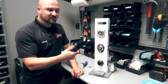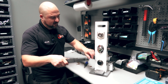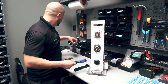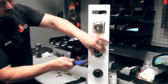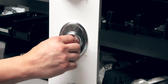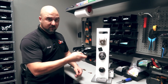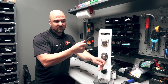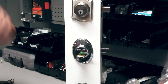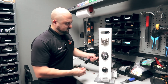I'm going to demonstrate it here — I've put the ring on so it'll bounce. I'm basically just going to hit and turn. This tool is made for bumping but I don't use it very often. I used to do it like this all the time — just take the end of my screwdriver and go like that. And there we go — got it just like that, unlocked. So lock it back — see how easy that was? That was with the screwdriver. If you want to use the fancy bump hammer, put it in there like that, and there you go.